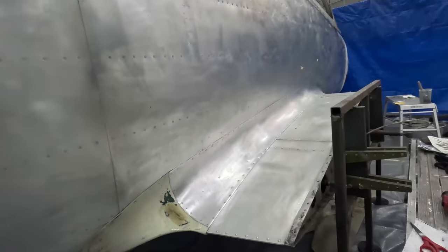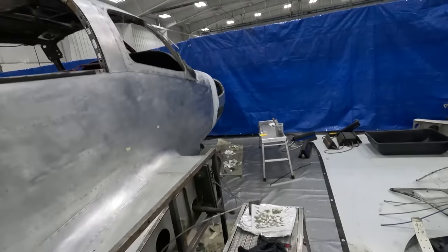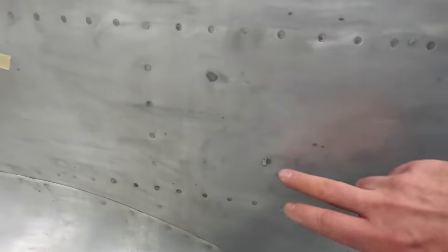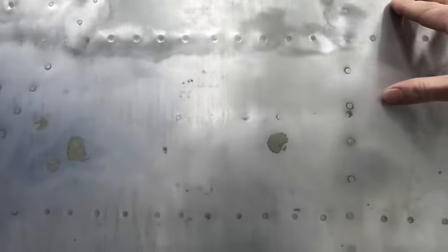And next I'm gonna be starting to work on some of the little Bondo spots. I got a little spot there, a little spot there. I'm just gonna go around and touch them little areas up, but nothing major. Some of those actually might not even need filler. If I can get behind there, just give it a couple taps, see if I can't bring that metal back out.